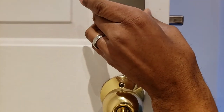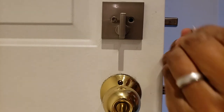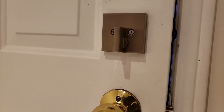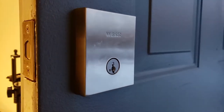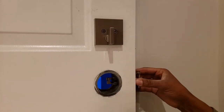When you're installing this part, make sure the torque plate fits underneath the latch. Then just find the bolts that correspond to the locking piece, screw them in, make sure both pieces on both sides are straight and level, and tighten everything up. Once you're happy with how it's seated, give the thumb turn a few cycles to make sure the deadbolt is moving nice and freely. That completes the first part.